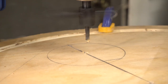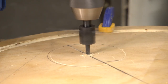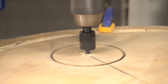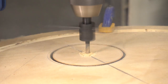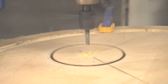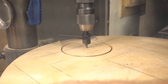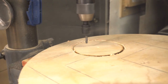For this project, I needed to be able to cut four, five, and six inch holes. I figured the perfect solution would be this adjustable circle cutting jig I picked up. Now either I really used it incorrectly or the one I got was just junk, but I can honestly tell you I hated using this thing. It really worked my drill press hard and created a ton of smoke just to cut a few holes in plywood. On more than one occasion, the set screw came loose and the cutting blade jumped to a larger diameter and made a big mess. Knowing what I know now, I would have just skipped this thing and used a jigsaw instead.